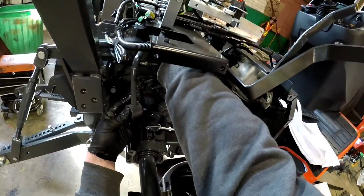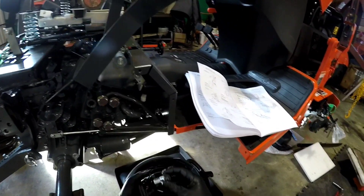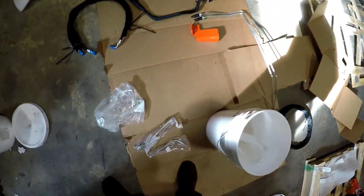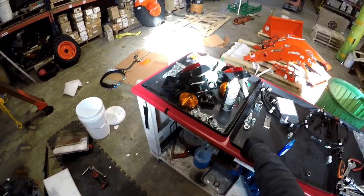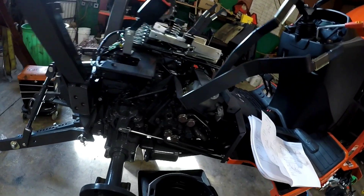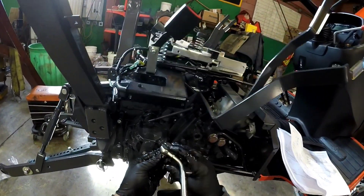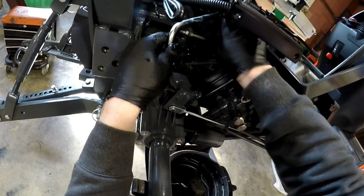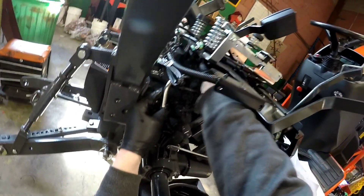This machine is also getting rear hydraulic remote valves - not going to reuse this. Get that crush washer off, we got new ones. I'll only throw trash on the floor just to speed things up. All right, we got new washers on our hose here - just work your way up there, see if we can get this thing spun on. Pretty easy.